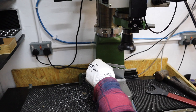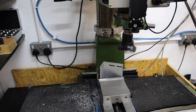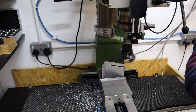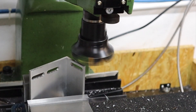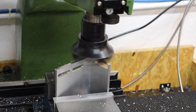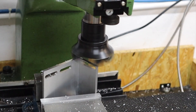After taking some measurements off the lathe, it turns out I need to take 2.5mm top and bottom off this extruded piece of aluminium. To do so, I'm going to use my 2.5-inch face mill, lightly touch off, and then go down in incremental passes until I hit 2.5mm. After that we'll flip the part over, do it again, and then go test fit it on the lathe.